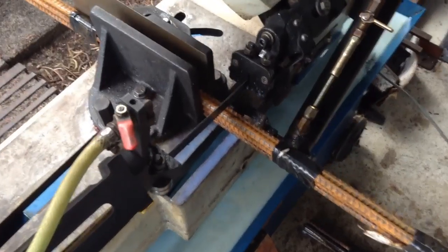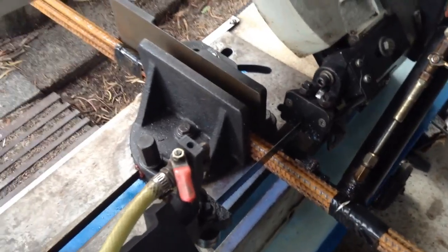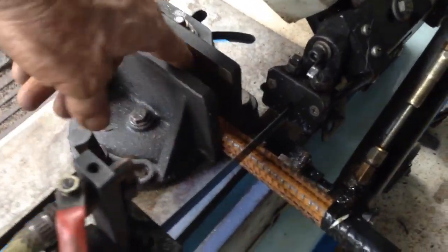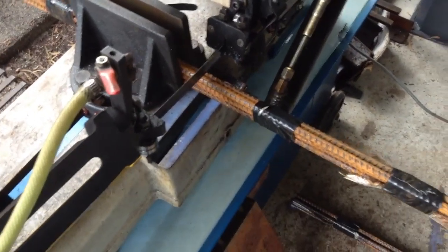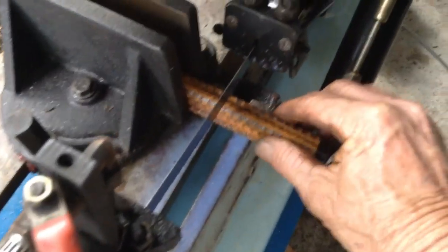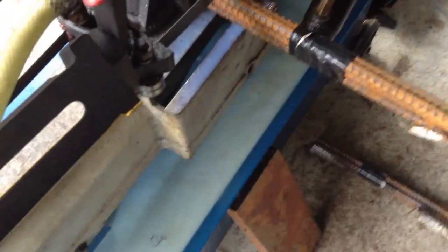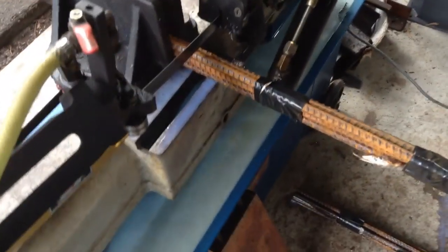So, over to the saw. We don't have our jaws modified yet for taking multiples of round bars, so that's an extra piece that bolts in here that stops them lifting. So I'll just tape them up at the moment and make sure that they're in line here. It's all we can do. It is a modification that I will have to do, so let's get cutting.